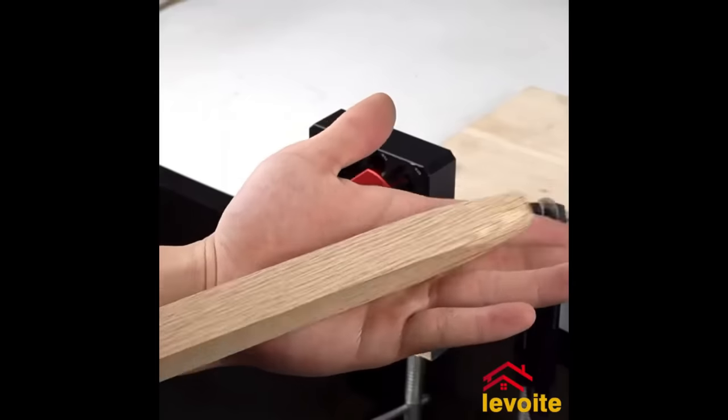The Wolfcraft 303-8000 Connector Pro-Easy is an innovative adapter designed to merge two one-hand clamps from either the Pro or Easy series. This fusion allows woodworkers to achieve a clamping width of up to 200cm, perfect for assembling sizable furniture items. Crafted from premium steel, its integration is straightforward and efficient — simply attach it to your existing clamps and tighten. Not only does this tool eliminate the necessity of purchasing lengthy, pricier clamps, but it also offers unmatched versatility in clamping tasks. Its one-handed operation is smooth, and durability is a given thanks to its robust construction.